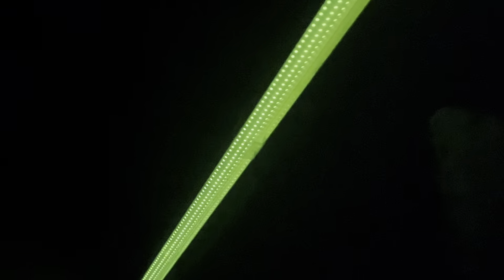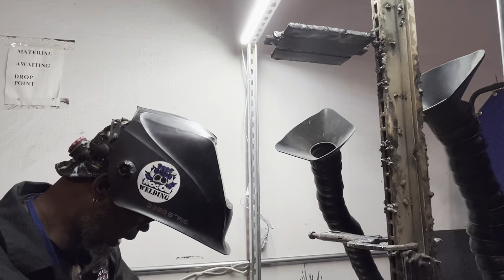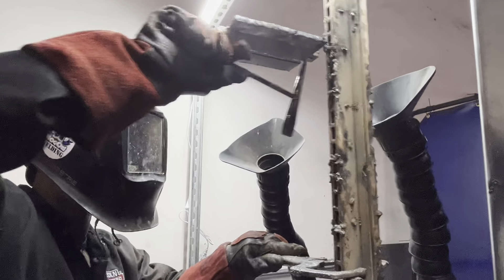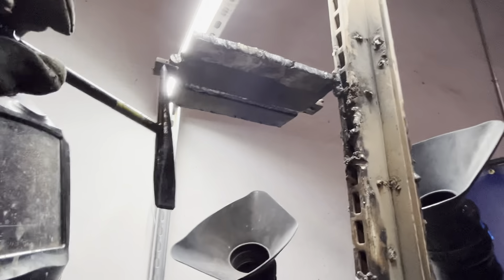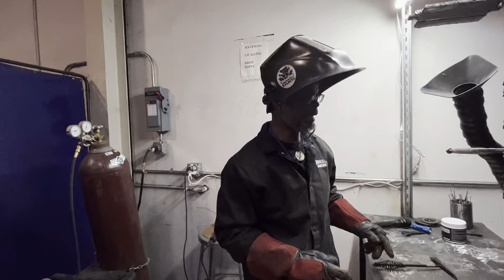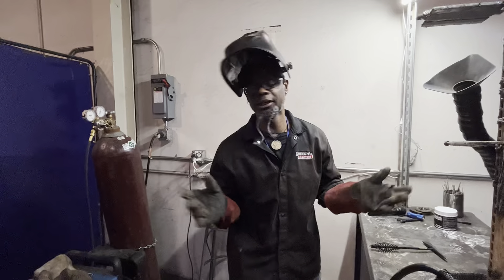Remember, you want to maintain your travel speed — it's very important. Because if you go too slow with the wire, you can fill it up too much. If you go too slow, you will put too much metal into the plate, so just keep that in mind. I like to let the plate cool down before we knock the slag off — at least let the slag turn back black. Now I had a few people ask me about the gas: I'm rocking about 25 pounds, so anywhere from 20 to 30 pounds I think would be great.